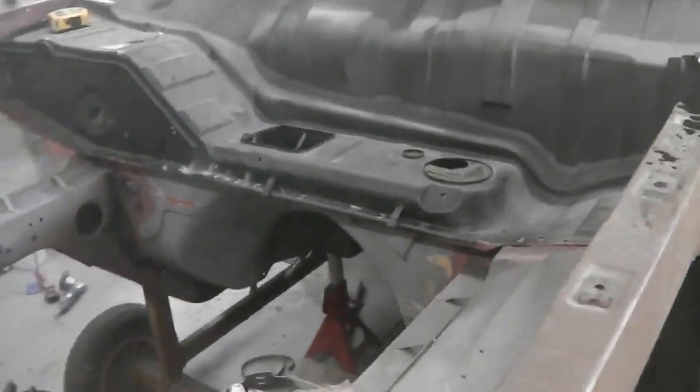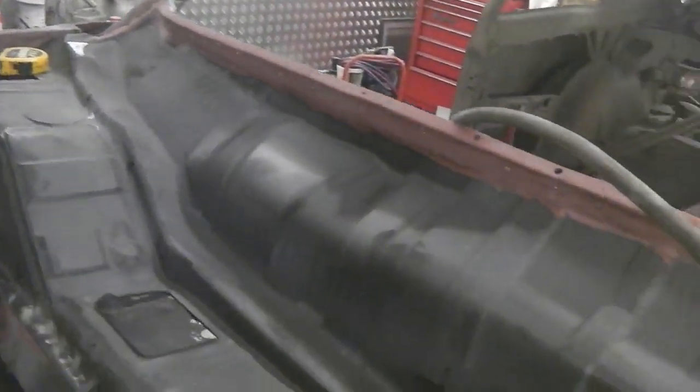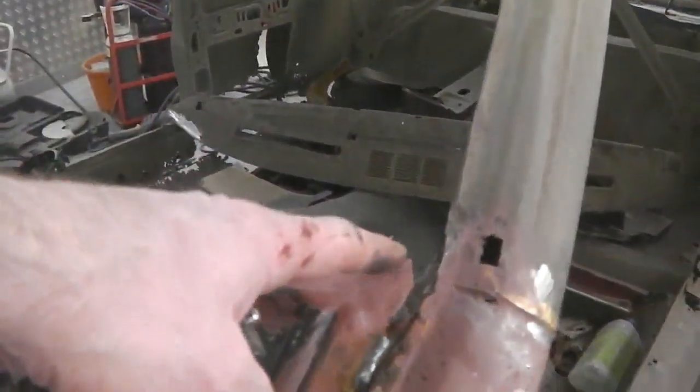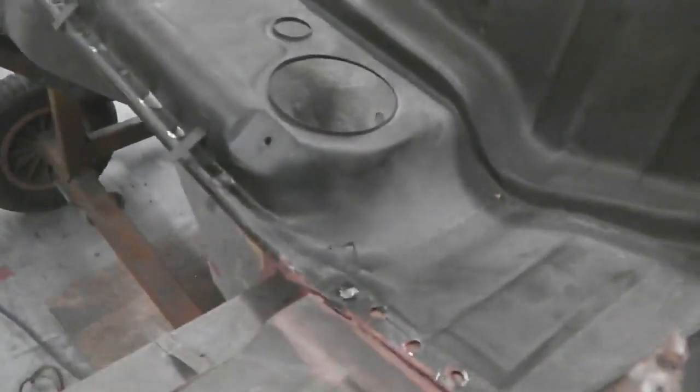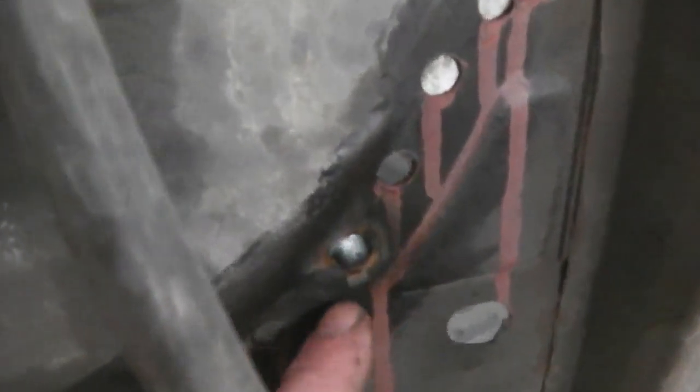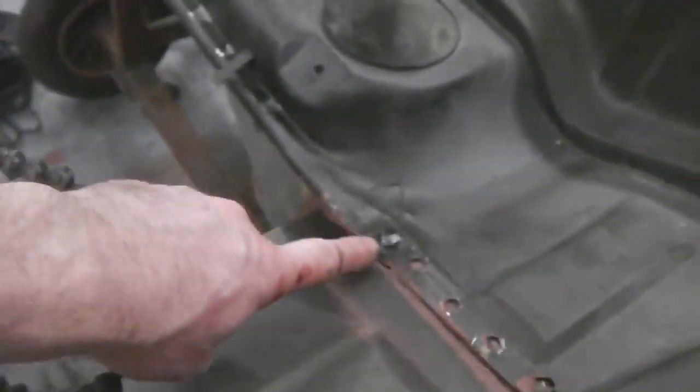Right, bulkhead is in position and we get our first weld down that side there. Tape measure over there to get the aperture, make sure it's right, but you'll get a bit of change on aperture when you fit the other panels, so we'll keep our eye on that to a couple of mil. We get a couple of plug welds in. One's just gone in there, and then one's just in on that top.